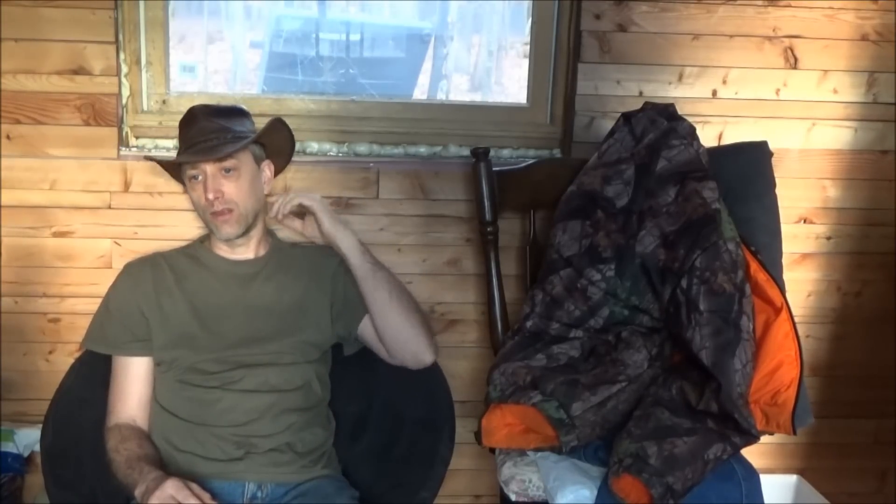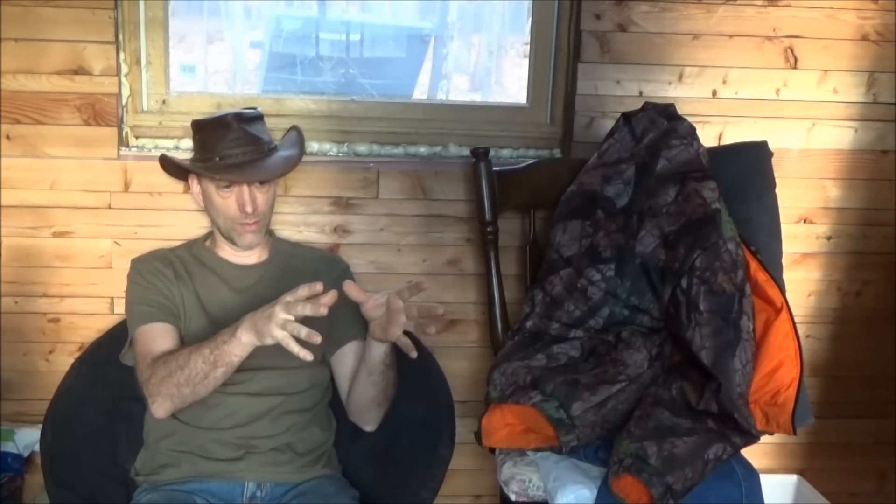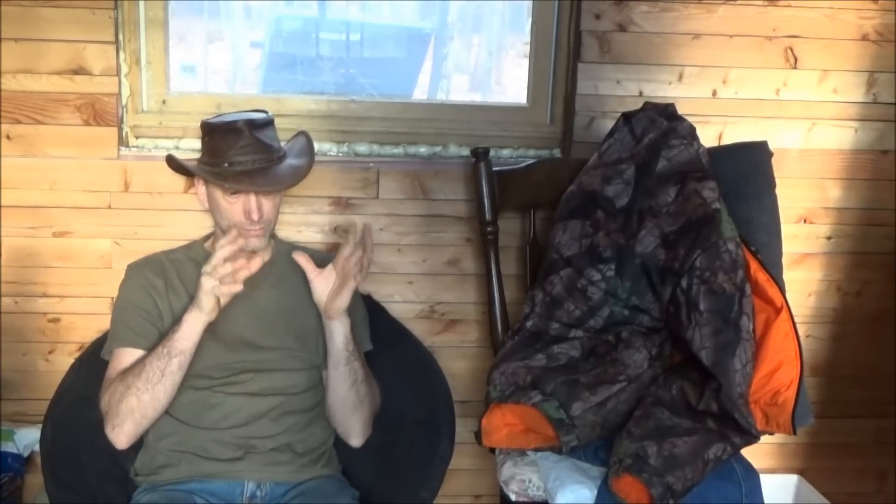I haven't been doing a lot of video recently — I apologize. I've not been lazy; quite the contrary, I've been quite active. I've been running the roads and out and about. I'm working on the barn wood, trying to sort it out — I'll probably show you that in a future video. Right now I'm laying it all in piles based on the type of wood: all the barn siding in one pile, all the 2x6s in another, 2x4s in another, and so on. Then I'm going to put them on pallets with branches or twigs underneath — just like the pros do at lumber yards — to keep air flowing and prevent rotting.